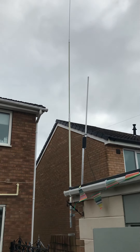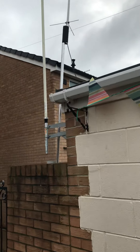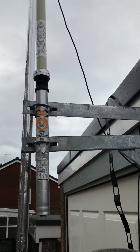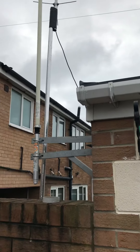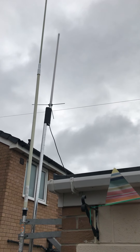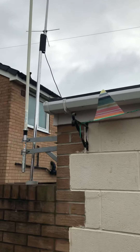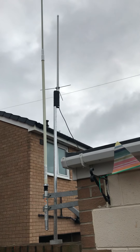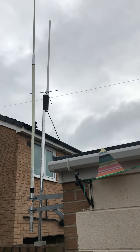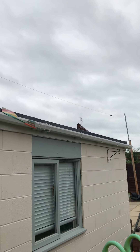It looks like we have had some wind overnight, but the A99 vertical is still standing. I have put the Diamond X300 further up onto a pole but it looks like I need some more work on that one. I am struggling with 2 metre operation at the moment — I do not know why. I do not know if there is a problem with the coax, but as I said I did buy 15 metres of coax and a couple of plugs, so I may change that and do a video on some 2 metre operation. I don't know if it is just the time of year and people are not really interested in 2 metre operation.